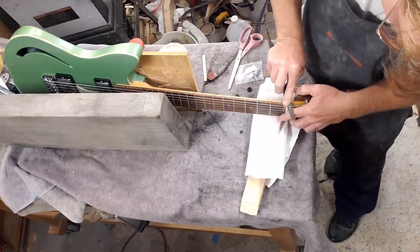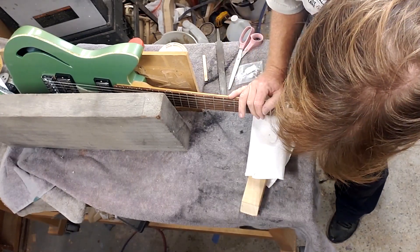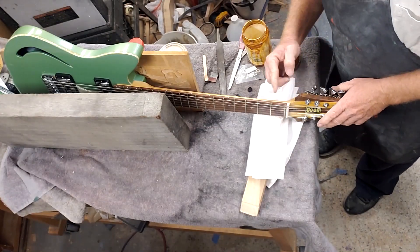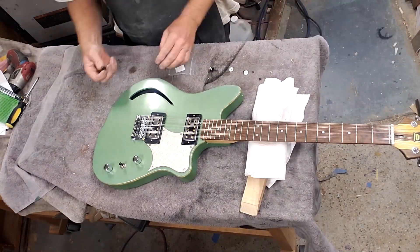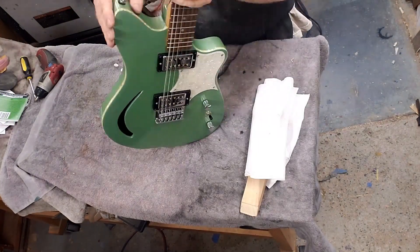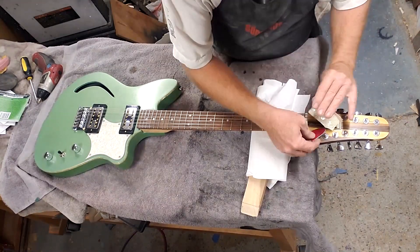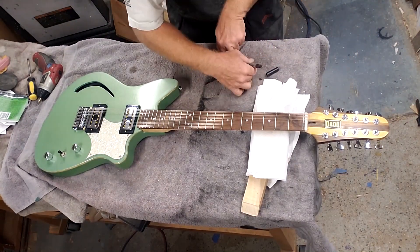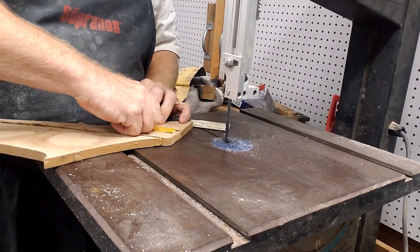This sort of goes behind guitars. Now it's all the final details - we actually have a guitar. That thing strums, I played it. Intonation still needs to be set up, but I'm done with it now. I'm just making sure that nut fits - it's a pre-done nut so it's a little wide, trimming it to fit and using a little shellac to cover up any wood I may have scraped. Screwing in the strap pegs. And remember that piece I had in my apron from the first or second episode? I saved it for a reason - we're going to use that for the truss rod nut access hole cover.